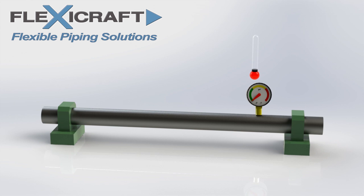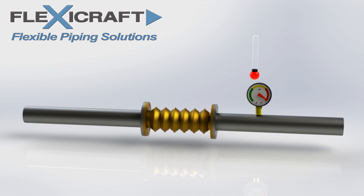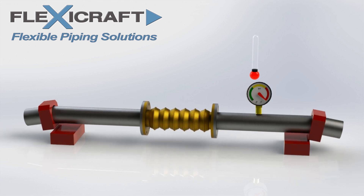We can now go back to our pipe system model, at first without the anchors. This time we pressurize the pipe instead of heating it up. The pipe acts as though it's plugged, with the thrust load acting on both ends because of elbows and other ends down the line. Notice there is no movement of the pipe because the pipe wall is too stiff to be moved by the thrust load. But if we cut a hole in the same pipe and add an expansion joint, we have a model like the bendable straw. Now when we again pressurize the unanchored system, we can see the joint will stretch out to failure because it's not stiff like the pipe. When we add back the pipe anchors and again pressurize, the joint does not stretch out from the thrust load because the anchors are preventing that. But if the anchors are not designed to withstand the new load, they can fail and consequently allow the joint to stretch out and also fail.